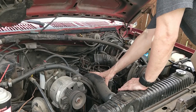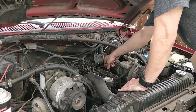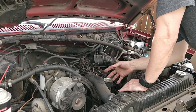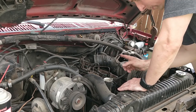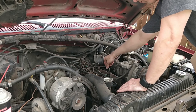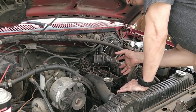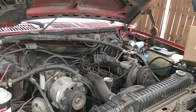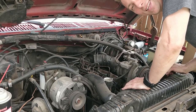They had a used assembly, and what they were doing was they pulled off all the fuel lines and everything together as one unit, and that's probably why they just took the housing off, so they can just drop it right back in. But what we're gonna do is take off the oil filler housing, the fill cap, the three bolts out of there. We're gonna remove our fuel lines from the injection pump, and then of course we'll pull the injection pump out and replace it with our new guy right here. So, with that being said, there ain't nothing to it but to do it.